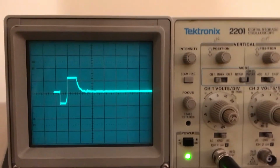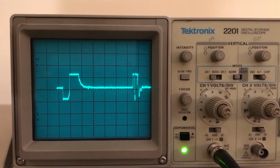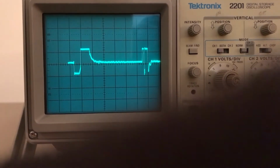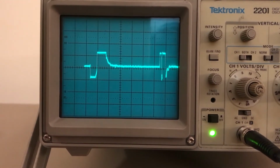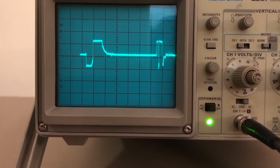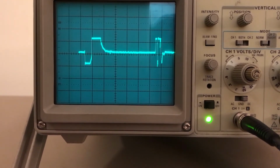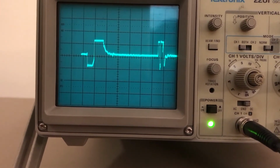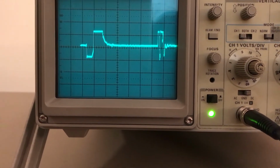Okay guys, I'm going to take another try at that aluminum sample. So I've changed my number of microseconds per big square on the oscilloscope. Okay, so now I have from the beginning of our incoming peak, 1, 2, 3, 4, 5, about 5.5 squares. So this is also a different dimension than the brass sample is. So I have to figure out my total travel distance, which is down and back. Okay, it goes from the top surface of the sample all the way through the sample, rebounds off the back surface, and comes back to my transducer.